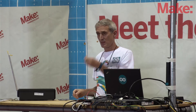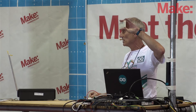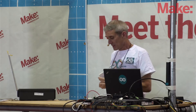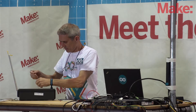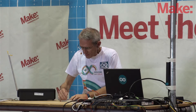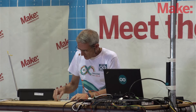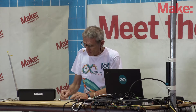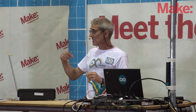But that's not really the fun part. The fun part is when you start adding other things to it. So let's see how difficult it would be to connect a different LED to this board. The way we do that is using this thing here called a solderless breadboard. The purpose of the solderless breadboard is just to make it easy to make the connections. I'm going to connect a wire to number 13, then connect my LED. And then I need to use a resistor — LEDs do not have the ability to regulate how much electricity they use. They'll try to take as much as they can and burn themselves out. So whenever you use an LED you have to use a resistor to protect it.